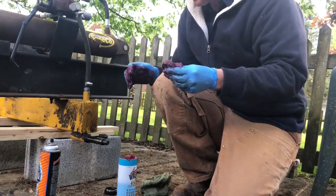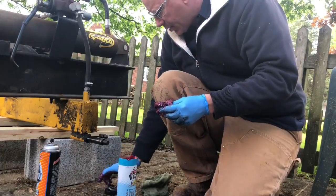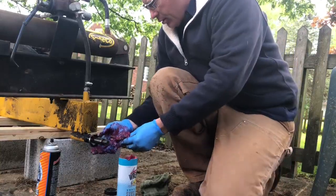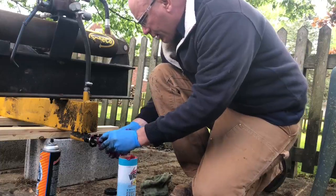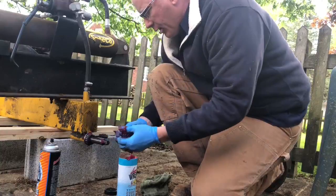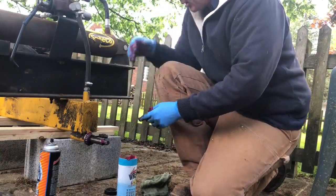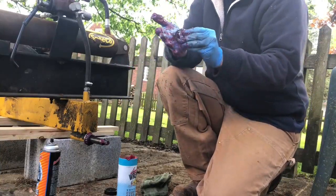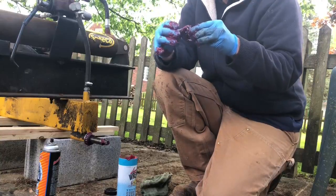So next step on that is the reassembly, and for that we need to take this part, and then this one goes in. And then we'll put the wheel on, and we'll pack the other bearing here and assemble the whole thing, putting that nut back on just hand tight, using the pin to hold the nut.